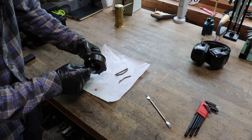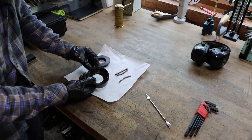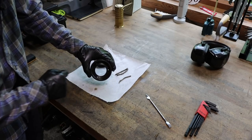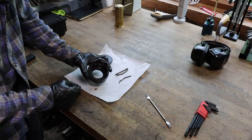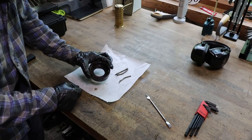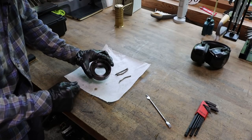So this is the large nut that holds the belt pulley on the top of the Doall milling machine. It's also an oil reservoir. It has three wicks in it. You can see those three holes, hopefully. Those wicks are jammed in those holes so hard that I can't get them back in, and I can't imagine that they oil very well being compressed that hard in those holes.